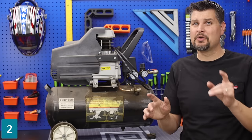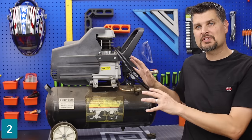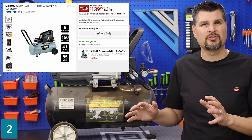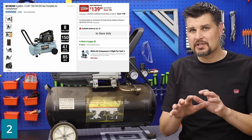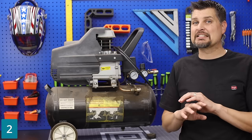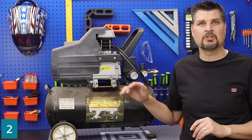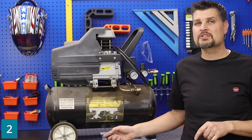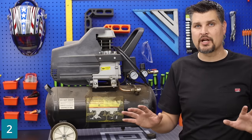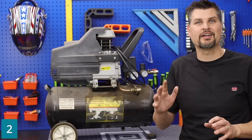Now speaking of a well-used tool, the Central Pneumatic 8-gallon air compressor. I kept this one in here even though Harbor Freight does not actually carry this exact model anymore — they've moved on to the McGraw. There are two things that help this sucker just keep going: first, it is not an oil-less compressor, so I've drained it once or twice and made sure the oil level is correct, and also that the drain on the bottom for the sediment and condensate is checked regularly. Those two things will save your tank and piston and help it keep going on and on.